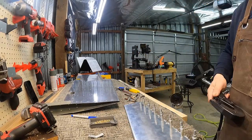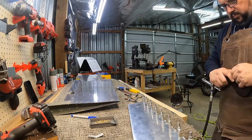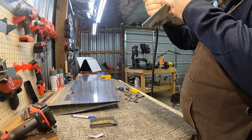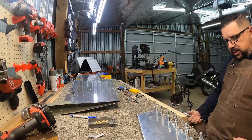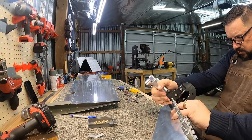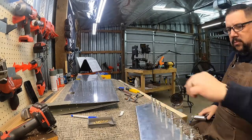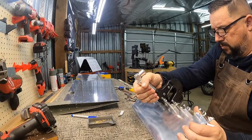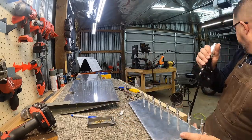There's some back and forth again on figuring out the right setup. For anybody doing this: use the three-inch yoke with a combination of different thicknesses of flat sets on both ends. That'll allow you to just barely get in there and set the rivets without crushing the loops for the hinge, because not every hole lines up in a gap you can get in between — some you have to go around the hinge. It gets pretty close and was a little nerve-wracking. I was afraid I was going to crush that hinge because it's just aluminum, so it wouldn't take much.